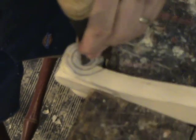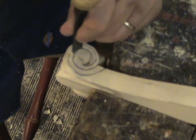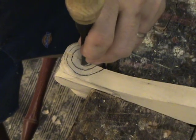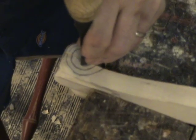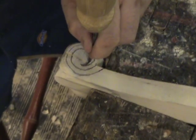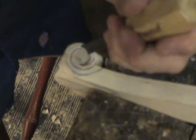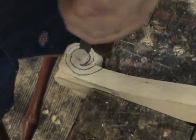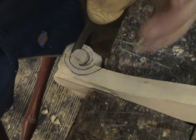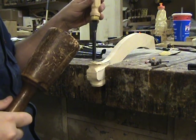Now I'm going to use the smallest carving gouge — it's only about seven-sixteenths to a half inch wide, but it follows this arc really well. I'll just tap down with the carving mallet about a sixteenth to an eighth of an inch, working my way around trying to stay right on the pencil line I drew. But what's more important is following the arc of the chisel.